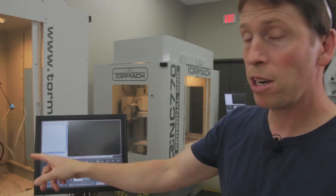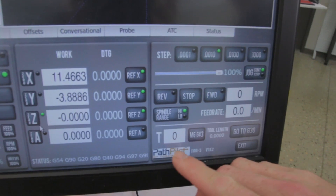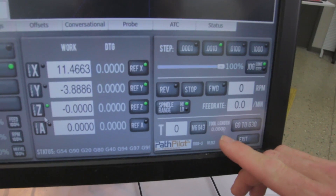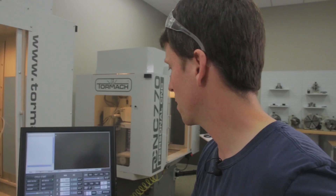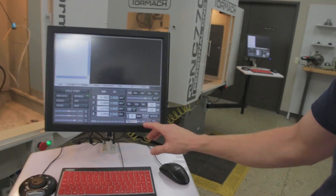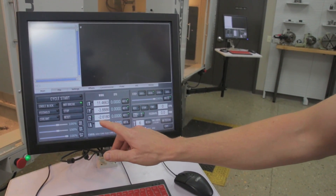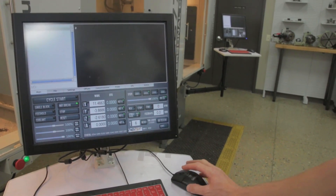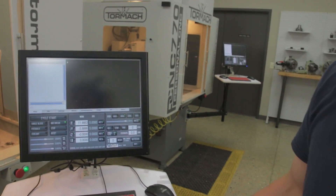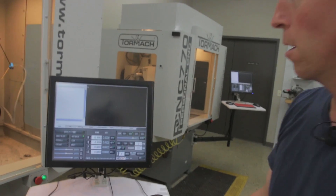Now I want to remind you of two important things. One is, the machine has no tool in the spindle and it's been told there's no tool in the spindle — T0 is shown in the tool DRO and the active tool length is zero. That's very important. If we lied to it and said tool 6 was in the spindle, tool 6 has a measured length of 2.5 inches, so the Z zero point would be incorrect. So it's important, before you set the work Z zero by touching off an empty spindle to a workpiece, to make sure there's no tool in there. That's how we got our Z zero.